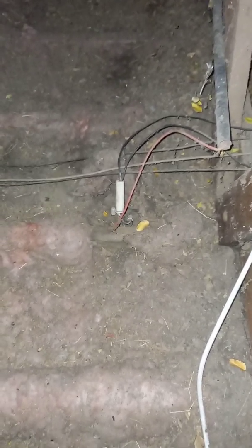I hope you enjoyed this — it's just to show you borrowed neutrals and what a problem they can be. It's a hidden danger because you don't know it's there, and it can shock you. It's also a potential fire hazard, but especially that shock hazard is not good when you think something is dead. Always best to switch off the main circuit breaker, the RCD, or the main for the whole installation so you know you're safe. If you found this useful, please subscribe and give it a thumbs up — I'll have more videos coming soon, including one with a trick with RCDs.